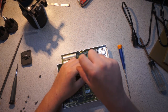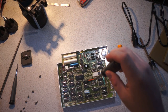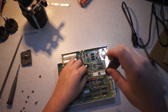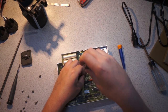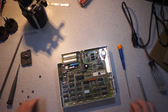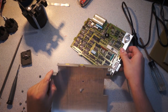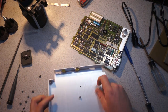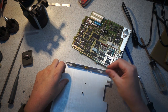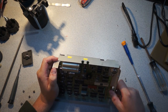So one thing of interest is that this test point is not grounded. It's actually isolated, though not very strongly. So I'm betting that basically this whole board is, well, no, it's going to be grounded through that TO-3 device. Okay, so that's the one differently threaded screw hole in the whole frickin' thing, the one I don't have the frickin' screw for. Rassum. It looks like a 6-32. Well, I finally found a screw that fits this little threaded hole, so I will finish up the reassembly.